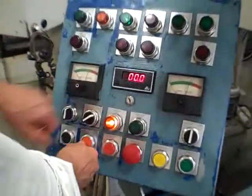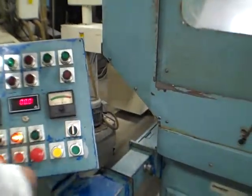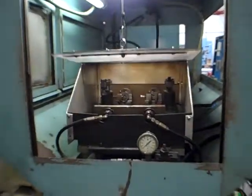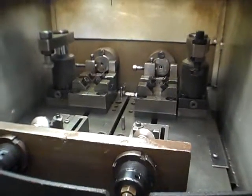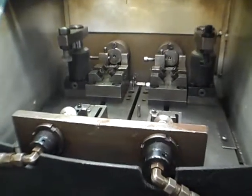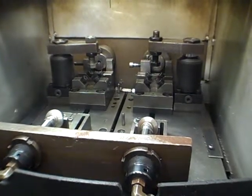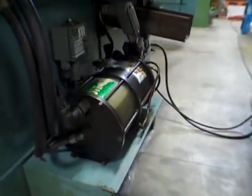Come around this side, get a manual for opening up the clamps and the door at the same time. Unclamp in manual. Let me clamp it once for you without going into the cycle — still in manual. You can see the pressure come up on the gauge here, we're at a thousand pounds. Got the air over oil boosters on the side — that's what we're utilizing for the clamping fixtures right there.